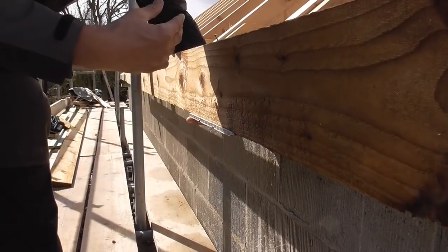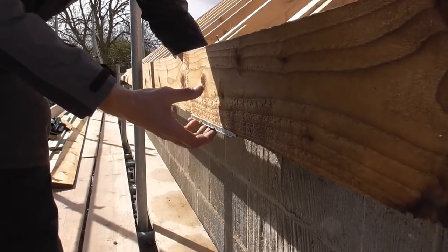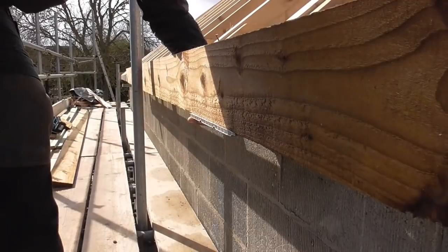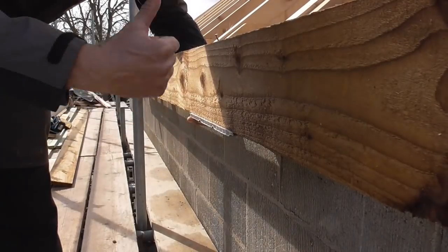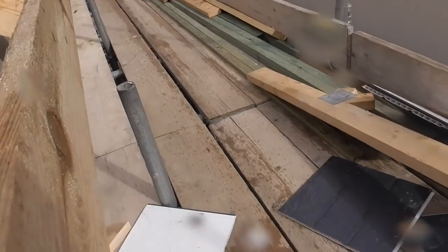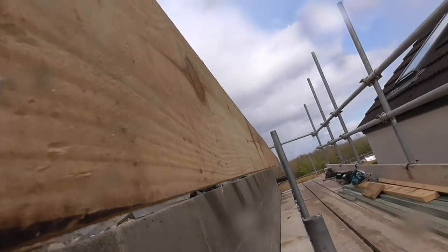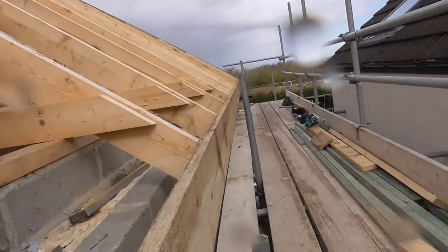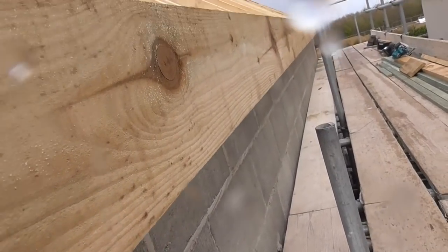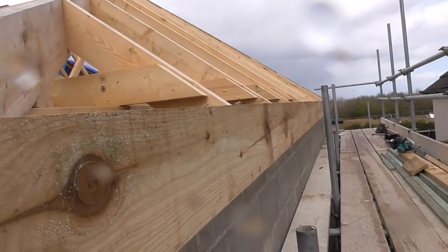Again, I've developed this technique through years of working on my own. So when I put the fascia on, I can just put a clamp at each end and then nail it up and pull it up tight. I hope you find it interesting, thanks for watching. So hopefully you can see down there — I've got a lovely straight line all the way down there. That is now ready to accept the soffit. The soffit will go under here, and the fascia will just pin on the top. A handy little bit of kit for working on your own, and it makes a nice job of that.